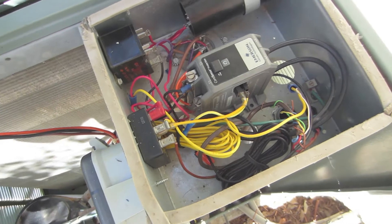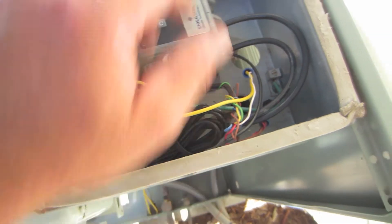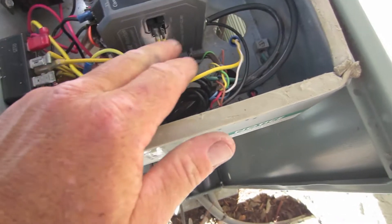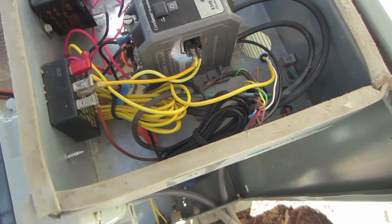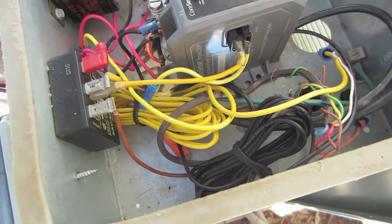Alrighty, the contactor is installed and it's pretty easy. This is my 24-volt coming in. I already have an insulated terminal — they send one with the core sense protection. I would suggest using the insulated terminal here, because you could potentially hit these two and just blow the 24-volt fuse.